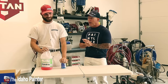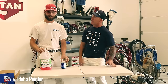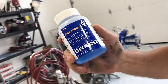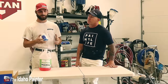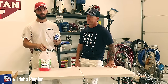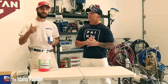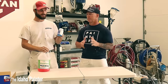So why don't you tell us why we use this? What are some of the benefits, and why we use RV antifreeze versus — this is a common one you'll see in paint stores — Graco's pump protector. You use pump protector to protect your pump against the elements. You don't want your pump to freeze during the winter, and you also want to put it through your pump all the time because it will keep that paint suspended in the hose so it's not drying to the outside of the hose.